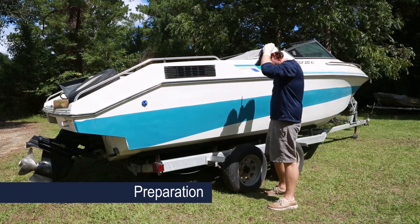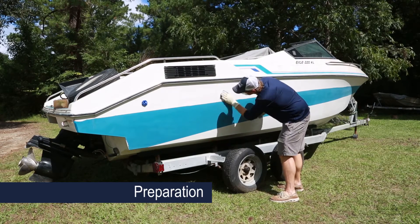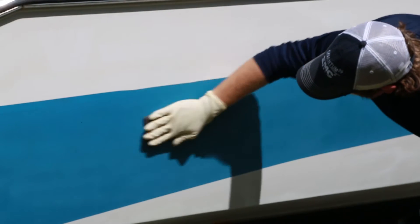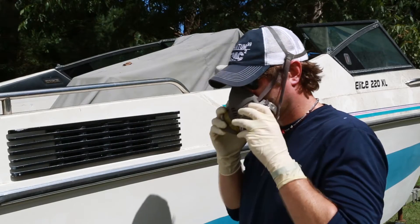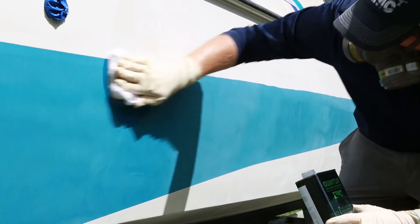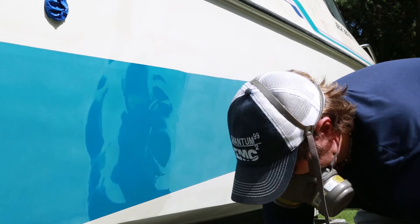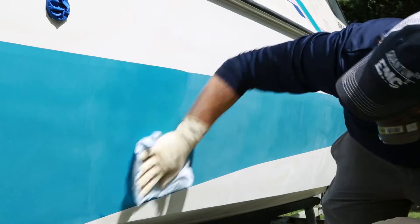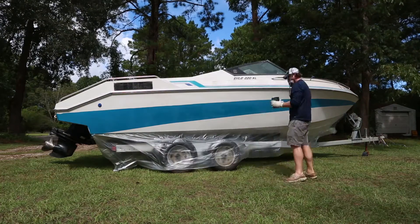Preparation is the most important step in the painting process. Wash your surface down with clean fresh water. While still wet, scour the surface with the supplied scour pads until the surface is water-break free. Once the surface is free from defects to your level of satisfaction, allow to air dry. Wipe down the surface with the Quantum Surface Prep SR002 using a saturated general-purpose rag supplied in the Genius Bucket. Immediately follow with a clean dry wiping towel, also supplied in the bucket, to remove solvent and contaminants from the surface. Do not allow to dry, as contaminants will simply be redeposited on the surface.